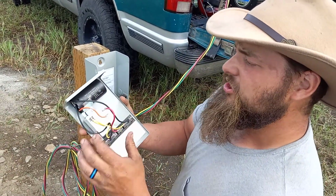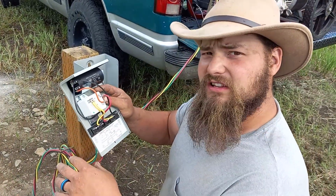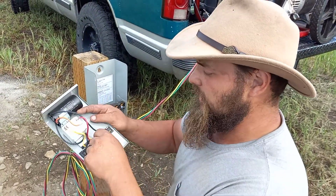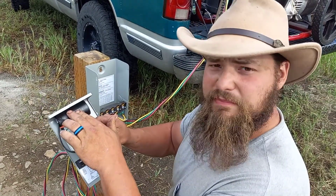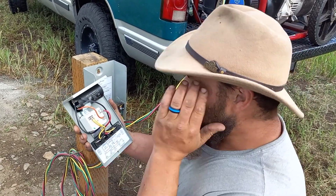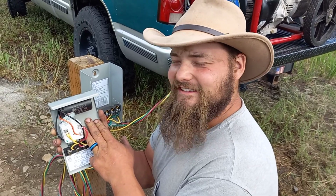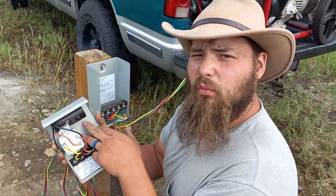It comes pre-wired. You can get a low water pressure sensor that you put in here, and it senses when your well is low and shuts your well off for a designated amount of time. It comes with instructions. I purchased one. It's fairly easy to install. You pull off the yellow and black wires. It clips onto there and clips into the capacitor. It's relatively simple, comes with good directions. But our low pressure sensor seemed to fail, or maybe the directions aren't quite as easy as I make it seem, and I failed. Either way, I had to eliminate that low water shutoff.